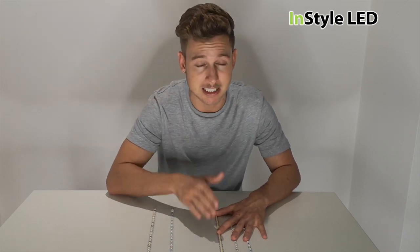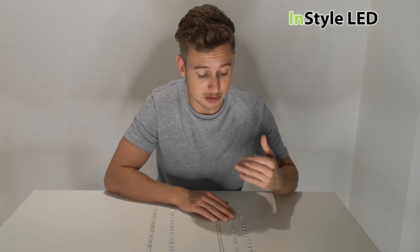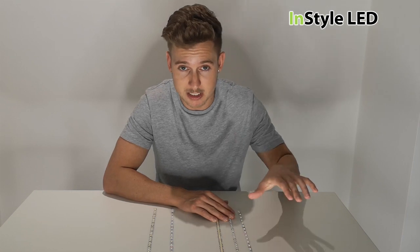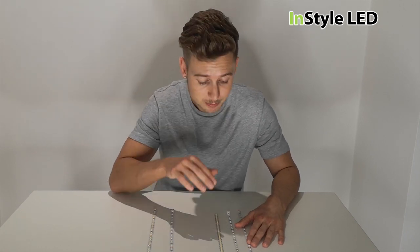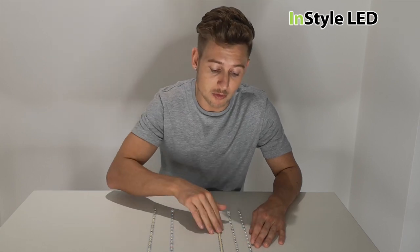For example, if you went for some low-level clip lighting you'd use 5 watts per meter; for feature lighting or under-cabinet working light you'd use the 20 watts per meter; and in a coving you may use the 10 watts per meter. So all three different wattages give off different light levels but all use the exact same LED, meaning the exact same color.